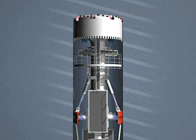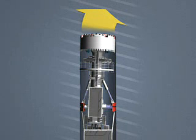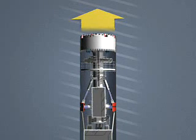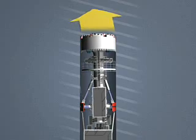The TBM can drive up to 40 meters per day. Hydraulic cylinders control the horizontal and vertical position of the cutting head. This makes it possible for the TBM driver to steer the direction at all times.